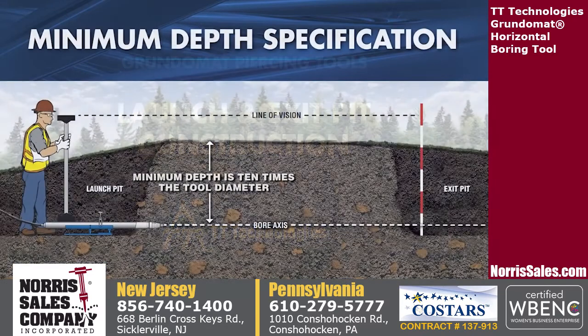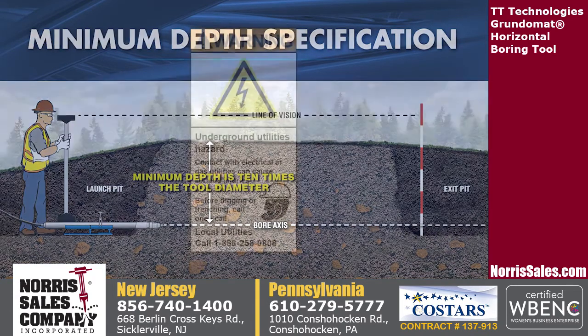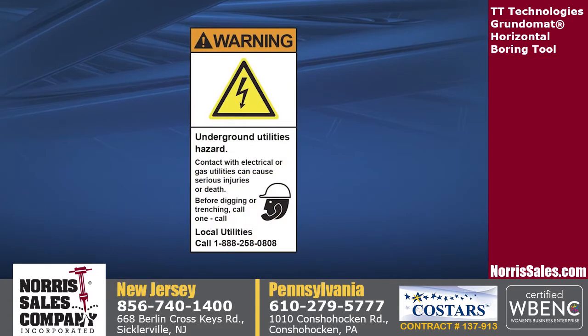Excavate, launch, and exit pits. Pits should be sloped or shored to conform with local safety codes. The minimum depth specification for pit construction is 10 times the tool diameter. Before excavating the pits and starting the bore, the Utility 1 call number must be contacted so that any utility lines can be located and marked in the area.